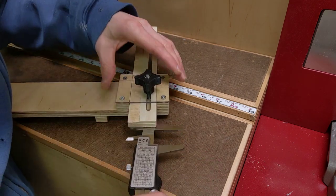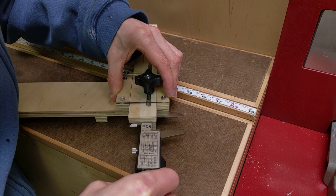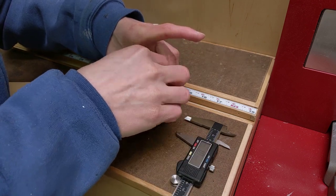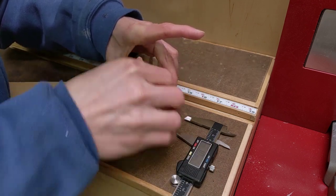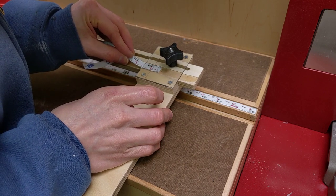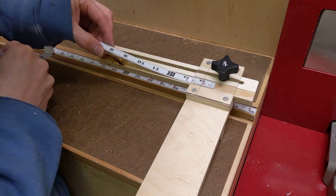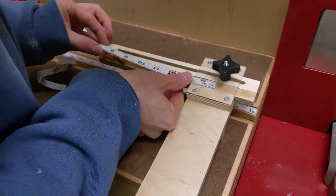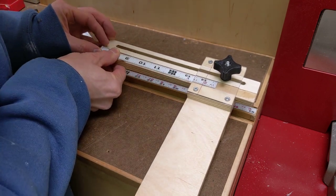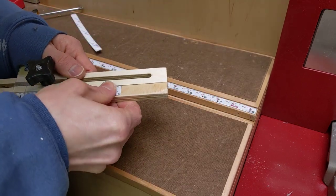To apply the tape measure in the correct place, I first set my calipers to 1 inch and then extended the arm exactly 1 inch and then locked it down. Since the tape measure on my workbench runs out at 15 inches, I applied the tape measure with the 14 inch mark lined up with the red line on the clear plastic. Since the extension arm is sticking out by 1 inch, this is now accurate. If I set the main stop block to 15, now the numbers on the extension block will take over and be the correct length.